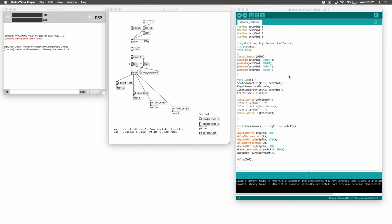Next, we're going to pop it into a loop so it constantly reads the distance from each of the trigger pins on the distance sensors, and then they go straight into the Arduino. Now, this next bit is vital in connecting them both. It's already reading the BPS from opening the serial port up here, but then we need to write what the distance sensors are reading. So from the left and right sensor, whatever you want to call them, they're technically X and Y, but I just called them left and right to make it easier to define them, because when I first set this up, they were just sitting next to each other. As each sensor is written, each of the numbers that they're inputting, they just pop them straight into PD.